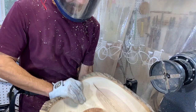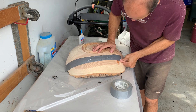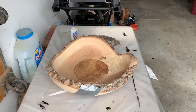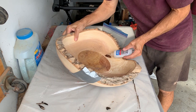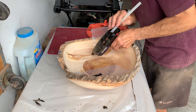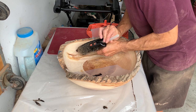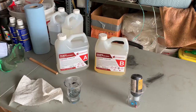Well, this crack is a little more serious than I thought — it goes through both sides and I'm afraid of that whole piece coming off. CA glue alone isn't really going to solve the situation, so I'm going to put a little dam on the inside surface and pour some epoxy in it to hopefully get into the crack and make it strong enough so it won't fly apart. I'm also repairing the knot using regular CA glue with a little bit of coffee grounds.